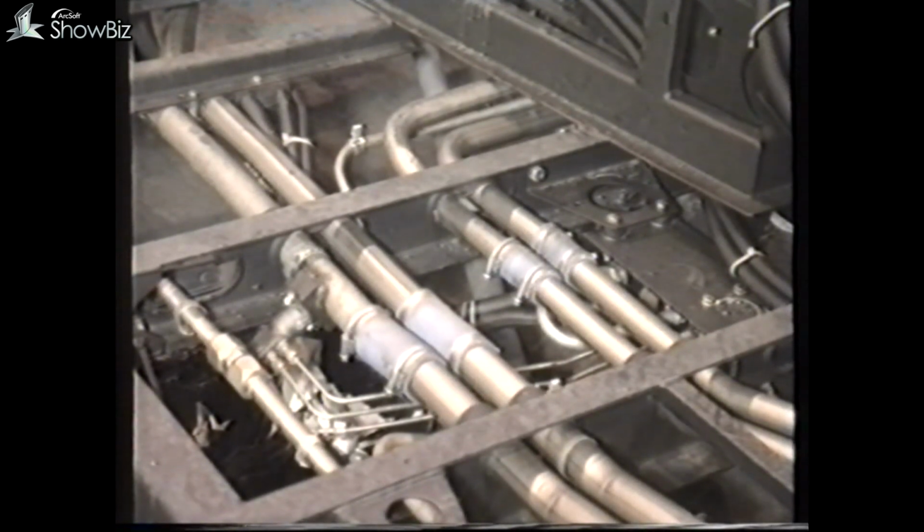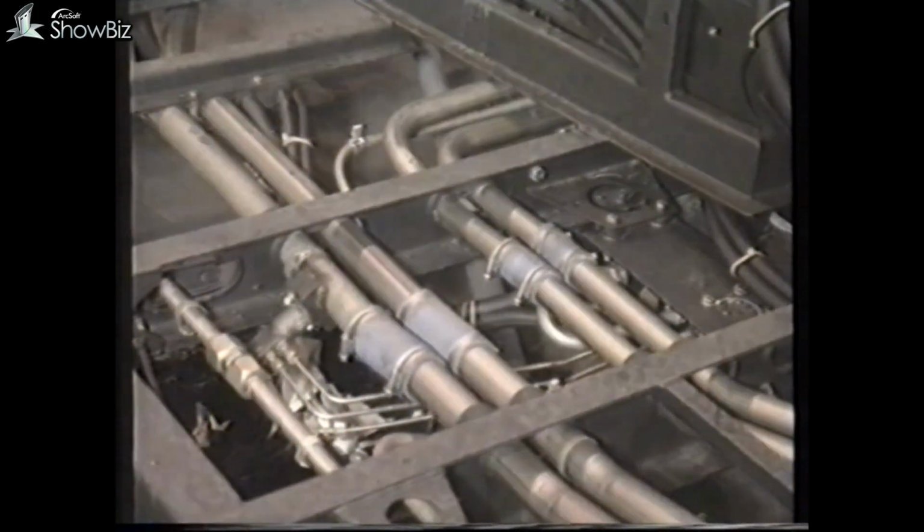To complete the cooling system inspection, check the condition of all water hoses and replace any which show signs of hardness or damage. If the system requires to be topped up regularly, a pressure test should be carried out to identify the leakage point.